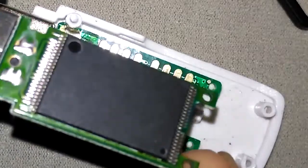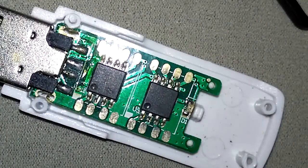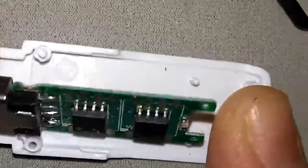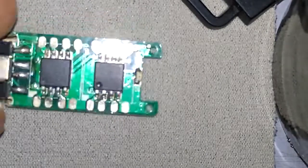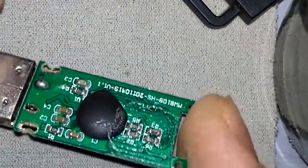This is what I found inside, and you can see it's not flash memory at all. This is what a flash memory package looks like — sometimes not packaged in a square, but generally like this — and then this is usually the controller. To be able to send me what they could probably find laying around in the shop, it looks like a modified EEPROM programmer — a little USB programmer made for programming these little chips. Some of these will have sockets so you can just pop the chips in and program them through USB. Flash memory simply does not exist in those sizes.